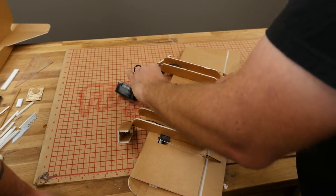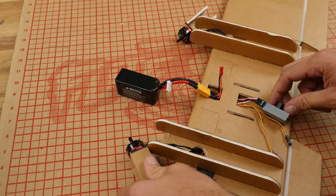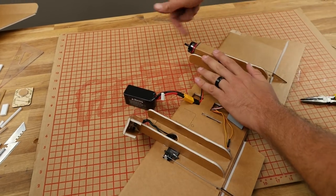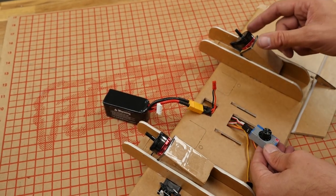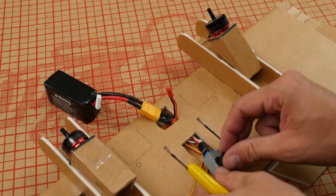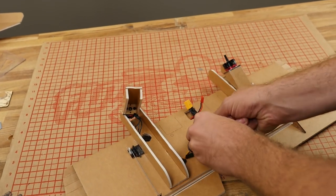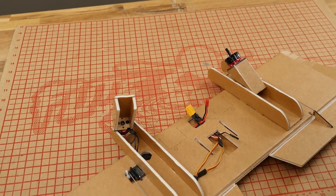Plug this in — it's turned all the way to zero, so it's not in calibrate mode, which these are actually all pre-calibrated. This one's going backwards — that's backwards. That one's correct. So you just have to change two wires. That one's going this way, this one's going this way — so we're all set. We can unplug this. We don't need to do ESC calibration on Lumineer BL Helis — it's already predetermined and pre-calibrated. Don't do that. It even says on their website: calibrate at your own risk.